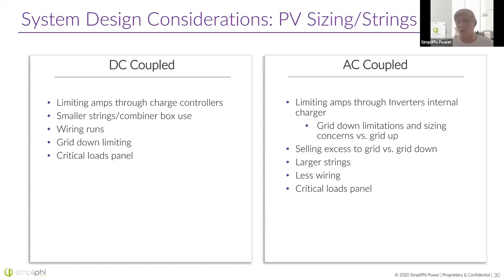If you need more power, you'll need more strings of panels, which means more wiring and often combiners to combine those strings so you don't have 16 wires landing on your charge controller. Wiring runs are very important to consider — if you've got 10 amps flowing through a 14-gauge wire over a 100-foot distance, you're going to lose a whole lot of that power: there's a voltage drop and an efficiency loss of power turning to heat within the wire. You really want to limit that loss to 3% or hopefully less. My recommendation is to use a chart like the one Blue Sea Systems provides for DC wire gauge charts to determine the correct wire gauge for your current and wire run length.